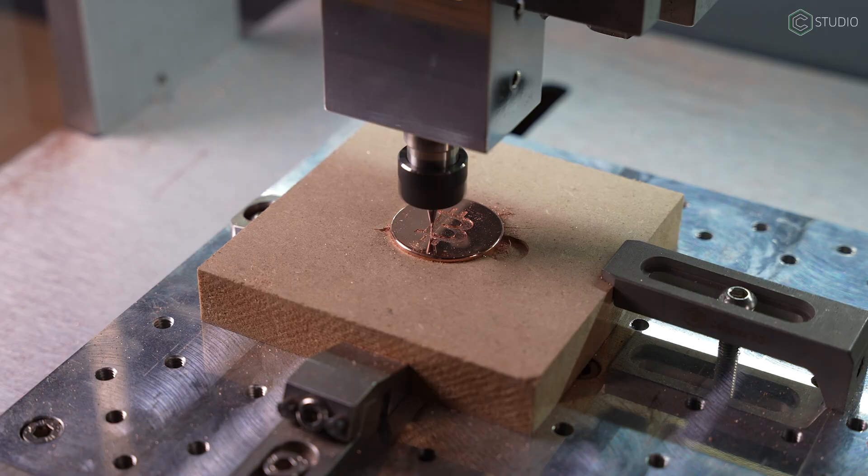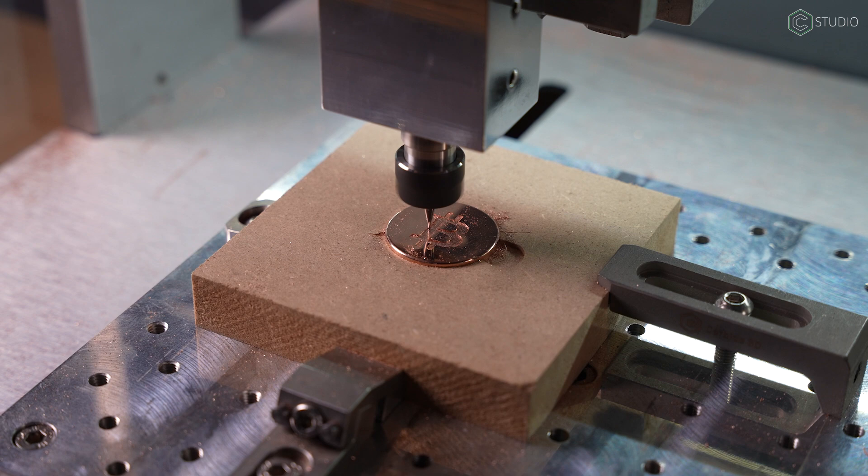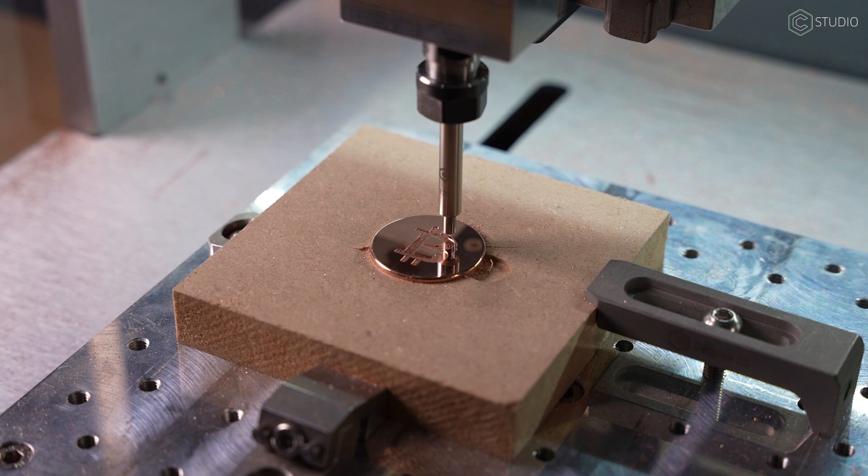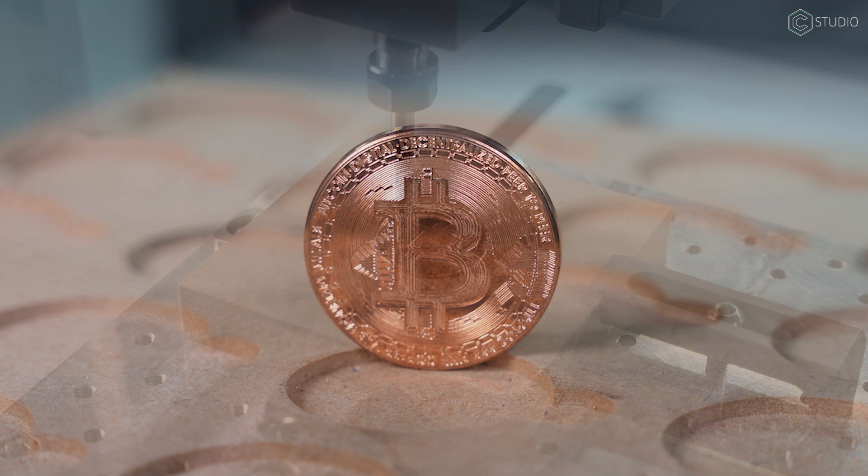After success with the emperor's coin, I decided to go back to creating the Bitcoin. I finished cleaning up the art and put what I had learned into practice. I cut the B with just 0.2 millimeters of depth, because you don't need a ton to make it interesting. Then I used the MC Etcher for the rest of the details. This is created with two simple toolpaths: a pocket, and then the texture toolpath. The MC Etcher is an incredible tool for metal marking of all kinds.